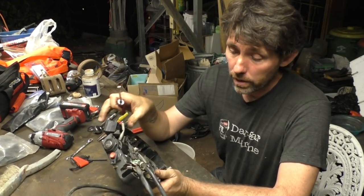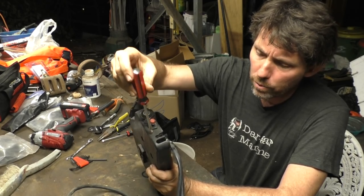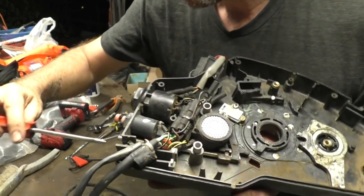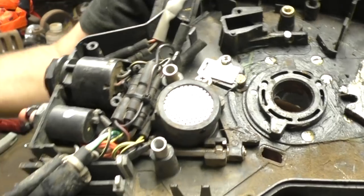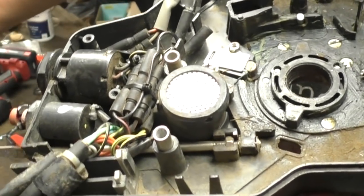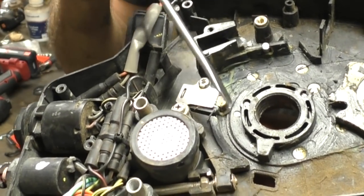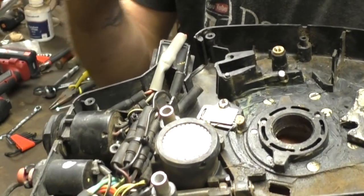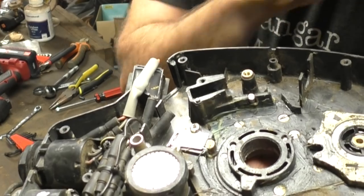The final mechanical part of this forward control is a little screw here, which is often labelled 'friction.' As we wind it in, you'll see inside there's a nut, and as we wind it it extends out and pushes this plastic brake against the metal mechanism — applying a bit of extra friction so it's a little bit stiffer and the controls will stay where you put them. On other brands this is quite often up here and adjusted from the front, but it's a very similar idea.